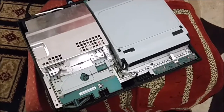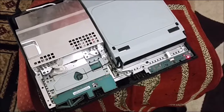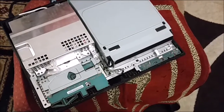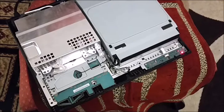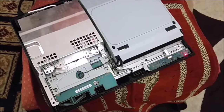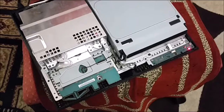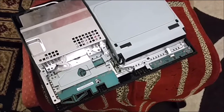It was so hard to get that chip off actually this time round. Last one I did just came off, and this one just wouldn't come off for the life of it. But we found out what we can use the heat gun for on chips. It does rework from yellow light of death, but trying to fix the chips from the loud fan and the overheating problem, you're going to have to remove the heat sinks, and removing the heat sinks is almost impossible without damaging the chip.